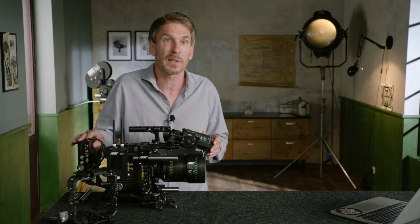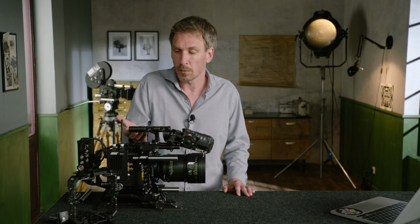The question that we have fairly often is what type of fusing, how are they protected? Well, all these boxes are protected by a polyfuse. That's a resettable fuse, soft fuse that doesn't need changing, it just resets itself on each of the accessory output that we have. So if you have an issue on set, you would wait half a minute and it resets itself when it cools down.